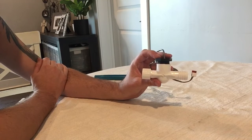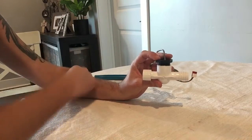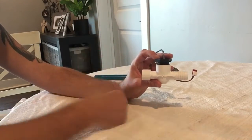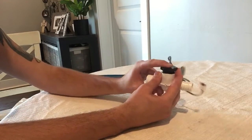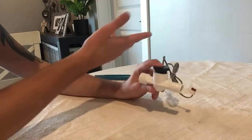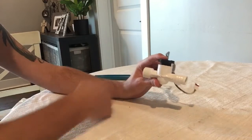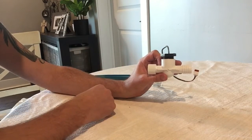That's pretty much how it works and how to do it. When you pull the sensor out, if there's water in the tub, water will shoot out — but you can just get it out, stick your finger over there temporarily, have your replacement ready with soapy water on it, and it'll slide right back down there really simply.